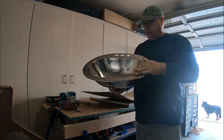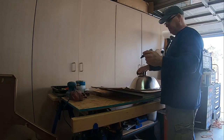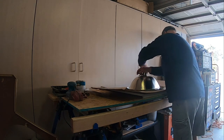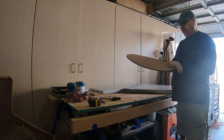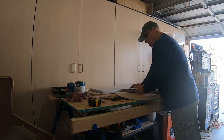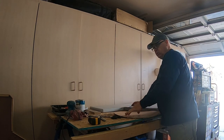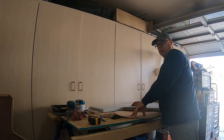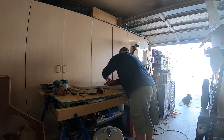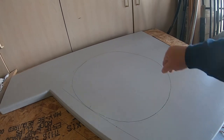This is the new sink we're installing — it's called hammered nickel, which we thought would look really nice. We're going to do a nickel faucet as well. I'm going to trace the outside edge, move in three-quarters of an inch, and then cut it on that line. I used the old countertop to determine the correct location for the sink, drew my reference lines, and then drilled a hole and cut it out with my jigsaw.